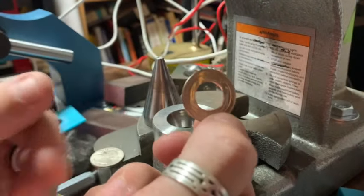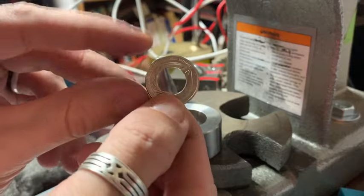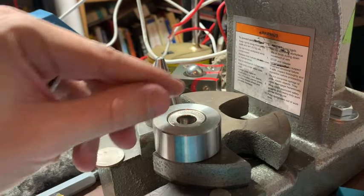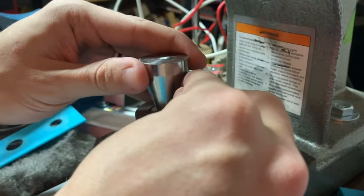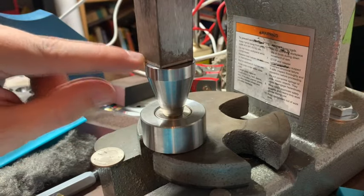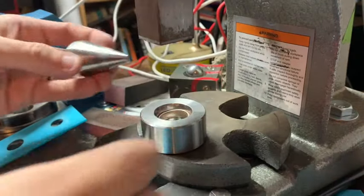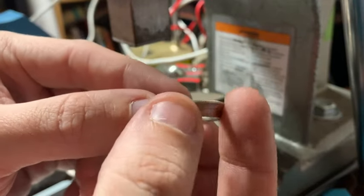You take your deburred coin with a hole in it and pick the side you want on the outside of the ring — I usually want the year on the outside. Put that face down, try to get the coin as level as you can in the die, then place your 17-degree folding cone on top and just fold it. You can see I'm having some trouble getting it perfectly level, which means it's difficult to get it to fold evenly. This is what we get — it's a little wonky. It's not bad, it can be fixed, but it's not great.